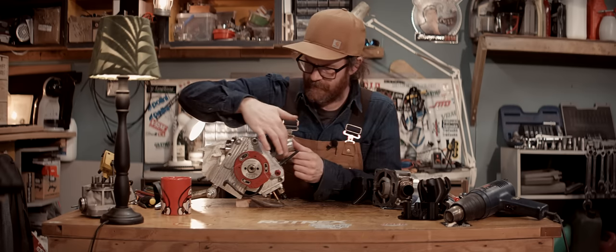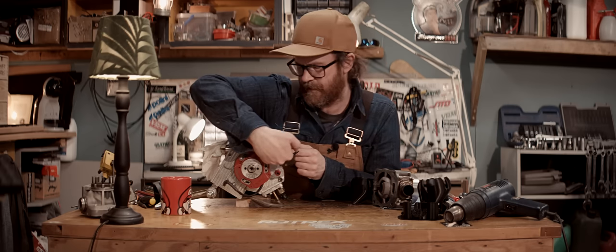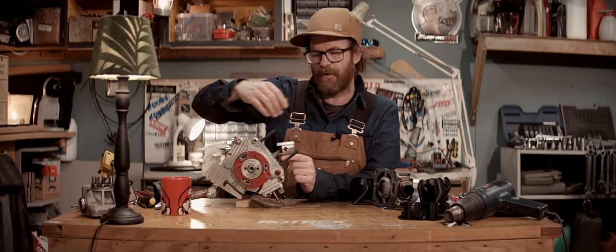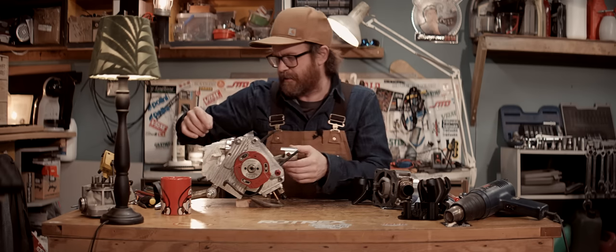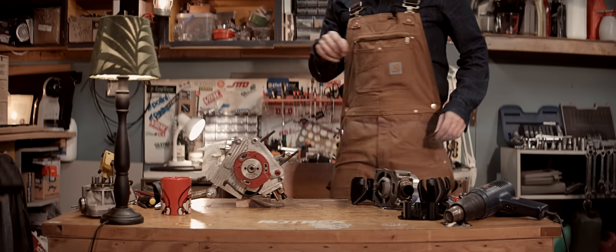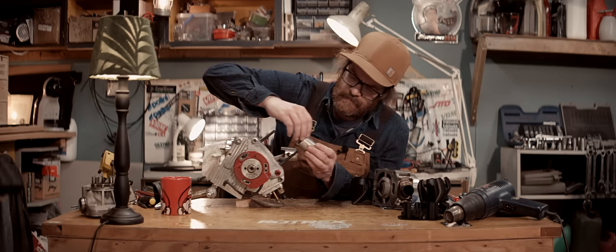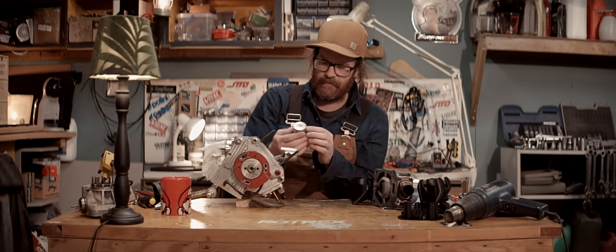I'll have to do some grinding to this piston to get it off, because there's no notch for me to grab the circlip. I'm running these C circlips, which are the safest circlips, because there's less chance of them being popped out by the wrist pin. But I'll have to grind a little notch here now to get that circlip out of there. Usually these pistons come with a little notch there. Not sure why they omitted that on this one.